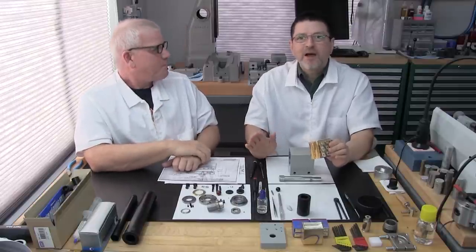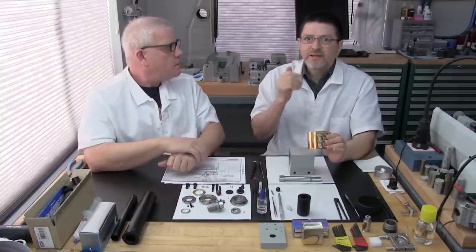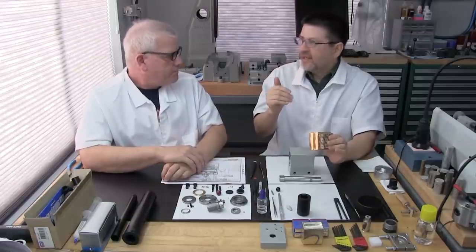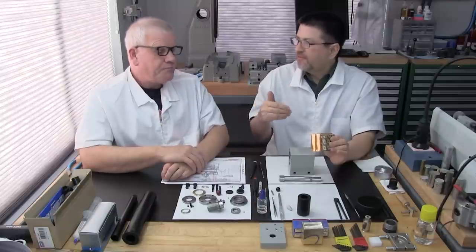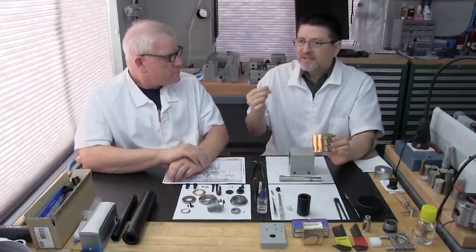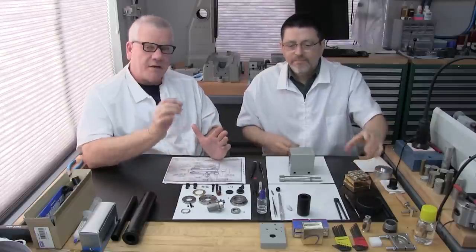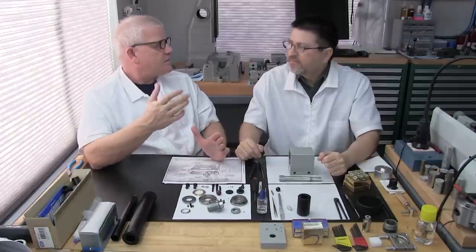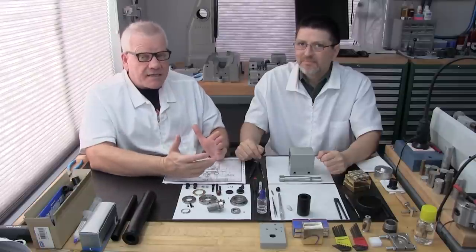So what I'm going to do is, off camera, open up the bearings and lubricate them. But we aren't going to share that on video, because in Part 3A, for the Levin accessory spindle, we went into great detail on using the syringes, filling them up with the grease, using the special blunt tips. And even under the microscope, we went into great detail on the application of the grease in the bearings. There's enough to focus on when lubricating, because we don't want that bearing grease to cause the bearing to overheat during the break-in process.